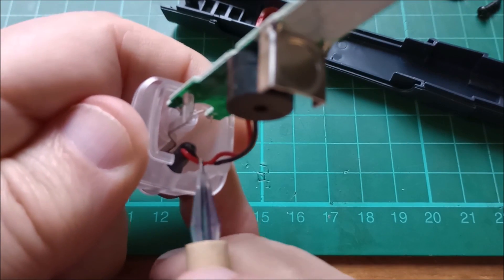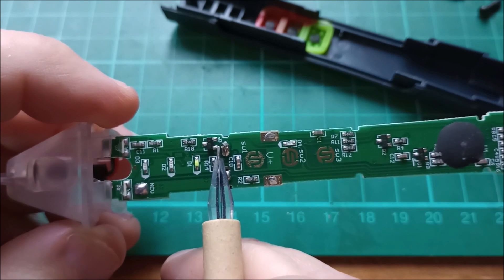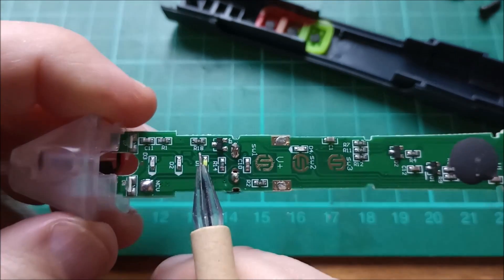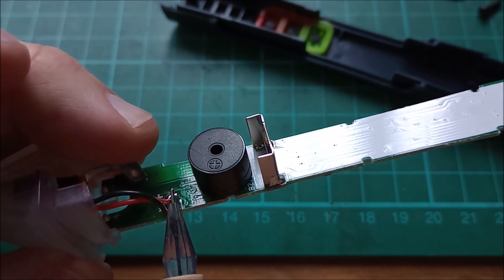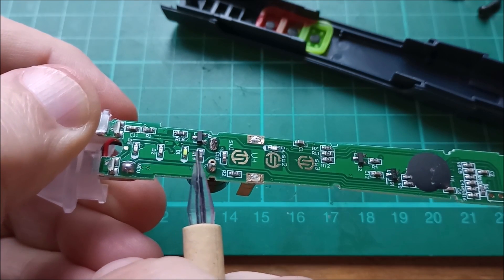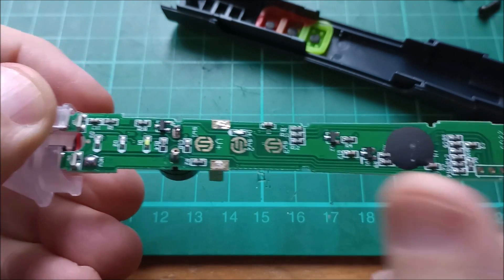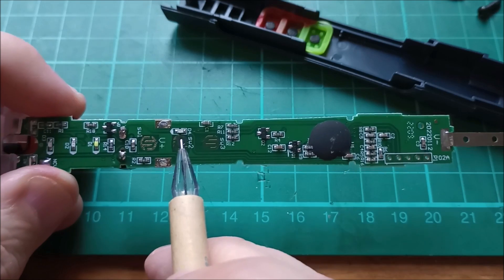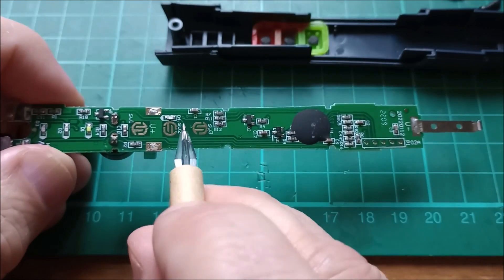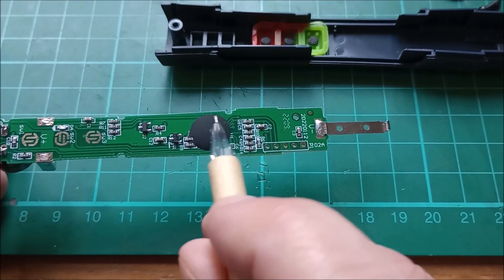The white LED to illuminate your work area is here. The laser is fitted and soldered onto the board, and the buzzer is here. There's a transistor, J3 — it could be a MOSFET — that's going to switch on and off possibly the laser. The laser connections are there, with the positive running back to that point. You would need some sort of switch to turn the laser on and off. There's another LED, D4, for the high/low sensitivity — it actually illuminates that middle button when you're in high sensitivity. A couple more transistors down here as well.